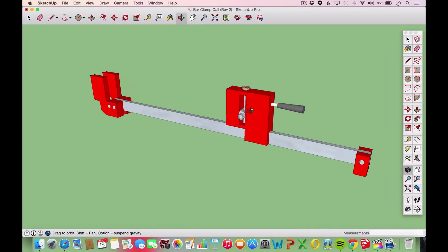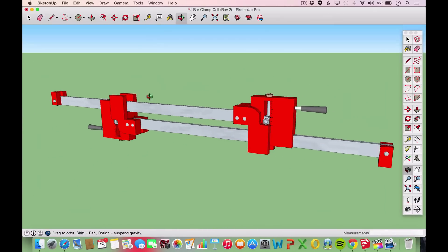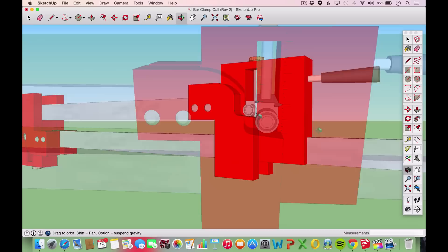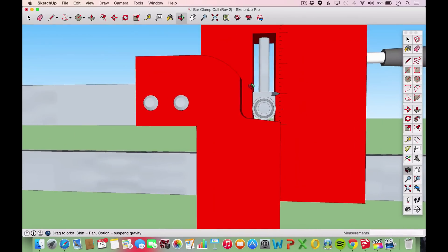So to take it a step further, I add a bearing on the clamping section that rides on a slanted surface on the tail section of the paired clamp. Now as the clamps are tightened, the two bars are drawn together and can act as cauls.